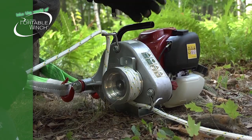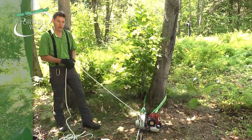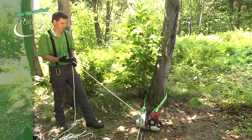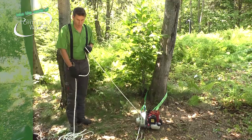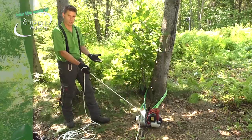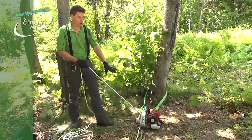It's really easy to operate and you can do it very quickly. When you're going to pull with the winch, it's quite easy — you just stand back about a meter and pull with both hands. Wearing gloves is a very good idea for safety. By standing back like this, you're never in the line of pull, so if anything happens there's no problem. Be aware of the rope accumulating next to your feet so you don't jam your feet around it. Same thing with your hands — when you're pulling on the rope, you just pull like this; you don't wrap the rope around your hand. It's a safety issue. When the drum is turning and I pull, the winch lifts in the air. When I'm done and want to stop, I simply release the tension on the rope and the winch will go back to the floor. It's that easy.